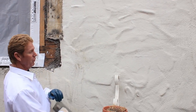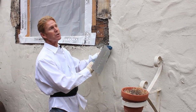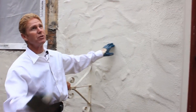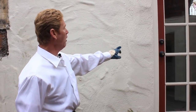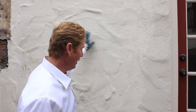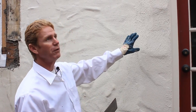What you do is you kind of look at these bumps. You can brown it and put the textures in the brown immediately, or the easier way for DIY folks is to brown it and then come back with your humps — I'll show you how we do it. But first I want to show you what they've got here. Can you see the difference? Those humps look kind of cloudy. These humps here don't have clouds — they have straight insides. You put the mud on and I'll show you how to do this too. These folks over-floated it. It's not too bad. I looked at it and said we'll match the original finish as well as we can. This has been painted about 30 times — it's a hundred-year-old house.